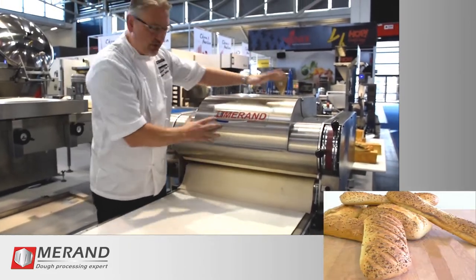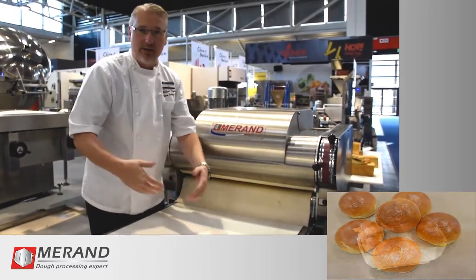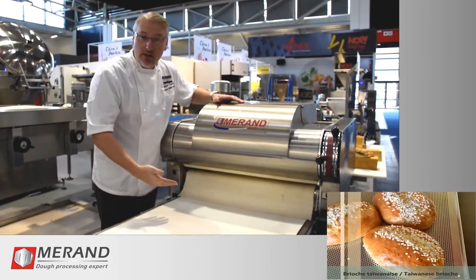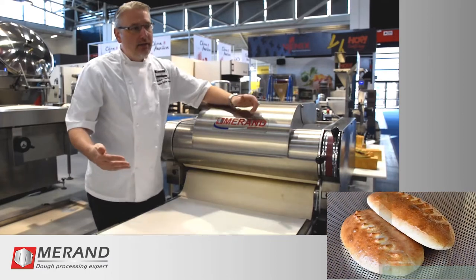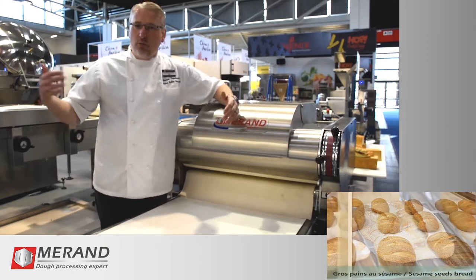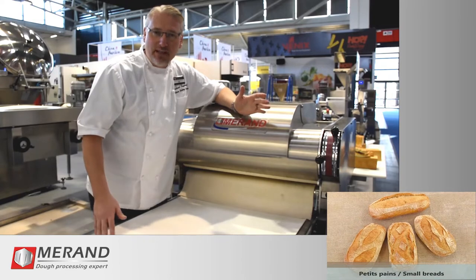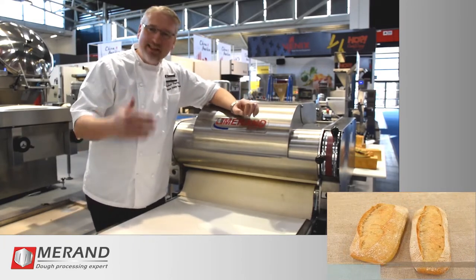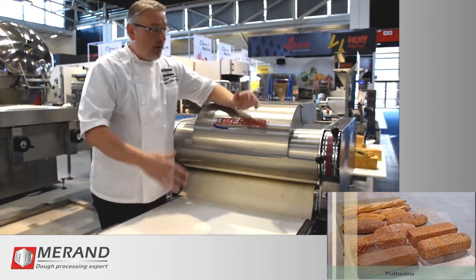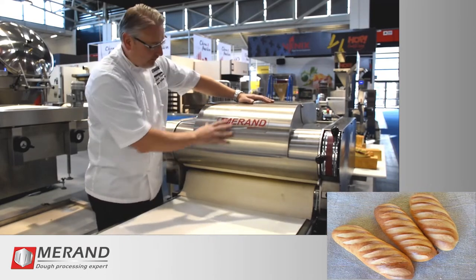Beautiful machine. This one's all stainless steel. HV stands for high volume. You might think of this in America as heavy duty, because it has heavier bearings, heavier duty transmission. And if you're a single shift bakery, going to run 8 hours a day, the regular Armor is more than ample. We've known bakeries that run those for 25 or 30 years without issue. But if you're going to continuously operate the machine in your bakery, where it might be two shifts or more, then we do recommend that you get into the heavy duty or the Armor HV.